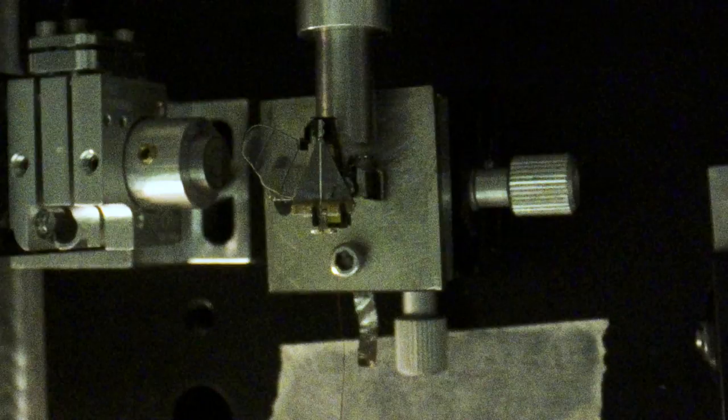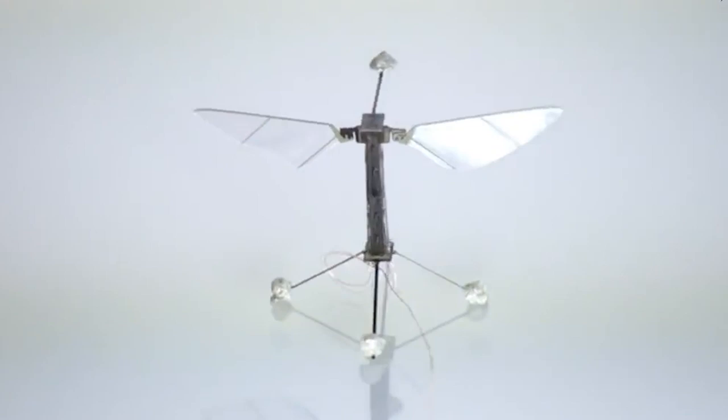Adding mass on board has a number of problems. I'm putting a power supply on board, so I need to be able to carry more weight. To solve the problem, we did a lot of little tweaks to the actuators which allowed us to generate much more force. But if we increase our force, we're going to increase our power. One way to prevent that is to slow our wings down, and a good way of doing that is to go from two wings to four wings.